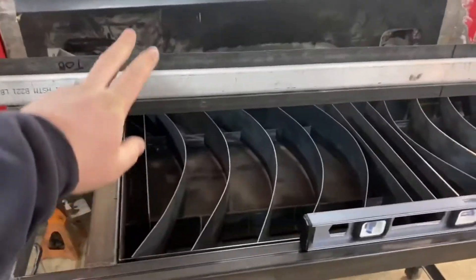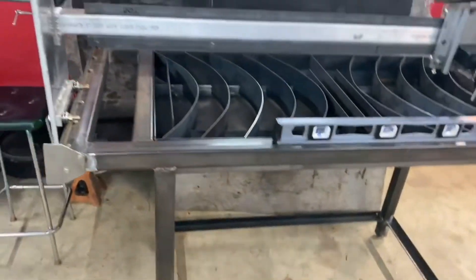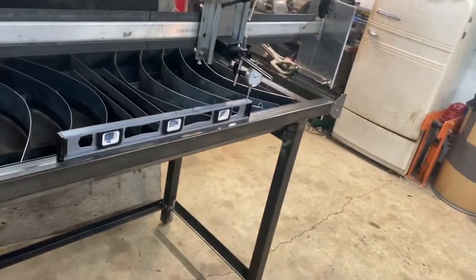I got her within five thousandths of an inch — that's probably as close as I'm ever gonna get this thing. You got to remember, we're using angle iron and some v-bearings, and this is all just mill material I picked up at work or at a local shop. Beggars can't be choosers. I can't really seem to get it better than that, and I've got to worry about the gantry too, so I'll probably have to do this all over again. But we'll keep working at it — we're getting somewhere. It's straighter than what it was.